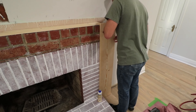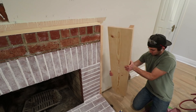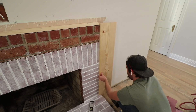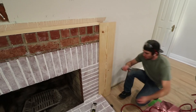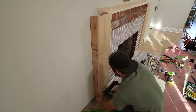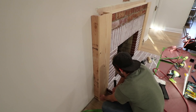If the 2x10 was only connected to one stud, it would easily flap around. So I ripped another stud and put it on the far side flush with the edge — this will also act as the support for the side faces. Once it was all level, I nailed everything solid with finish nails and even drove some nails through the stud into the wall. If any nails didn't quite make it in all the way, I used a punch and hammer to push them a bit further in. I followed the same steps on the other side. With as many nails as I used, this thing wasn't going anywhere — and it was okay to use a bunch here because most would get covered up with trim pieces anyway.